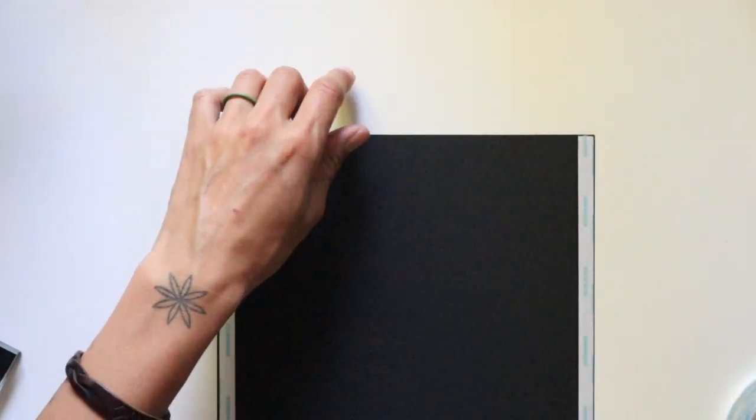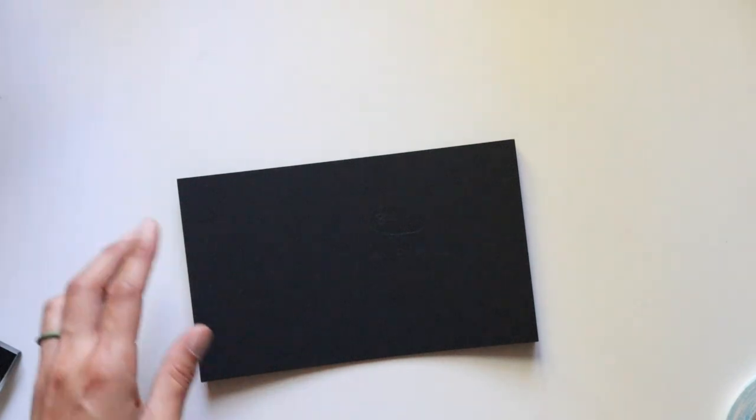That is a bingo, and you know what? I close all my pockets down again, like I mentioned earlier, with quarter inch score tape. And that's perfect. I like to do a little pre-burnish with my fingers, and we'll come back to him in a little bit. But here's his other pocket. I'm gonna repeat the steps.